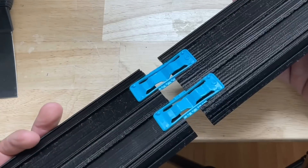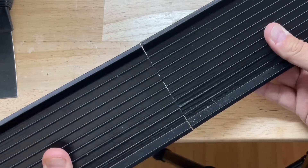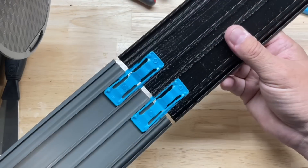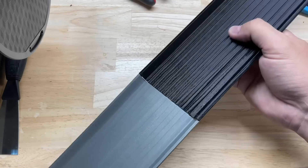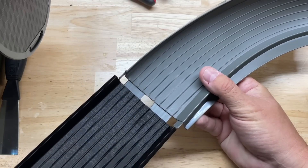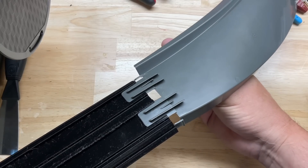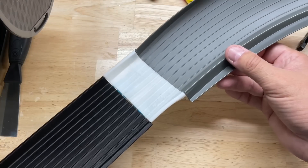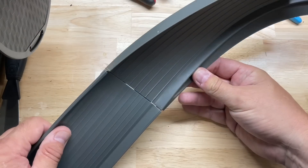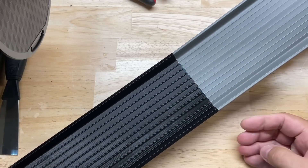The real question was: did I get my dimensions right and how well do these lock together? There are a few things I can still adjust, but overall it fit together nice and tight and it doesn't sag when I put it at an angle. It still connects to the original track, so I got that to line up pretty well. Where it doesn't work is on the curves — it's too stiff to connect to the little tabs. So for that I'll have to use a different method. I realized I could use that NinjaFlex section to make the transition, and that actually worked really well — or I could just use the original track and then connect my PLA track further down.